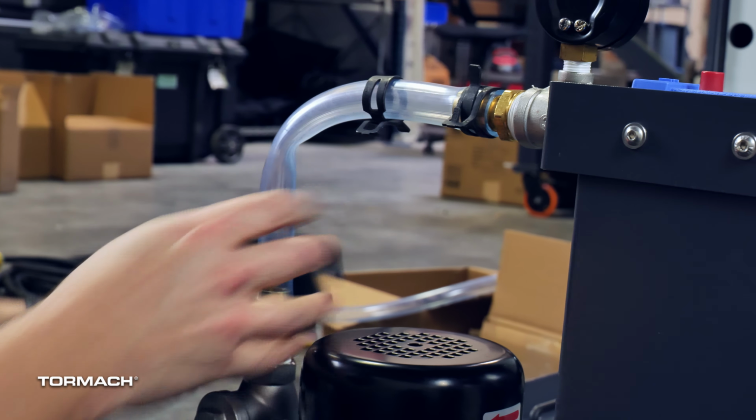Find the 2 coolant ring mounts. Loosely secure 1 coolant ring mount around the upward bend of the coolant ring, with the larger piece around the top with the flat end facing in. Then place this into the notch of the spindle mount on the right side of the coolant ring. And loosely snug the coolant ring mount on the right side of the spindle with a 4mm hex wrench.